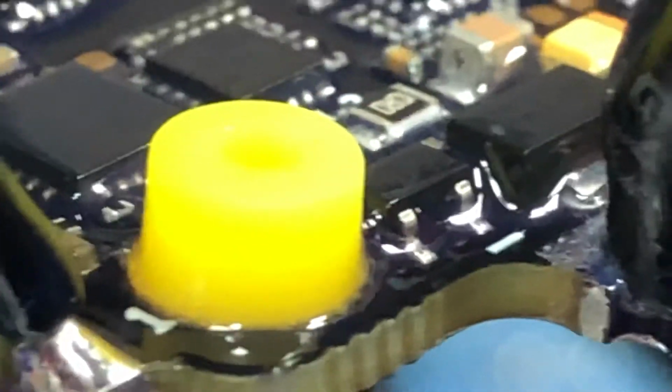So there is no way that any of the pins are exposed. You can see it. You know, when you look at it like that, you can't really tell, but as soon as you come down at an angle, you can actually see, especially along the grommets there, how much coating has gone up there. And right in there, you can see how much it seeps up onto the side of the components. In there you can see between the components, it's actually sort of formed a bridge.